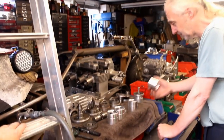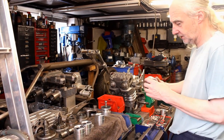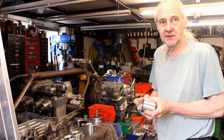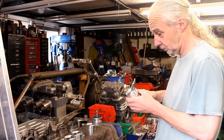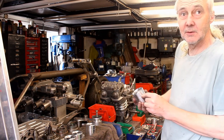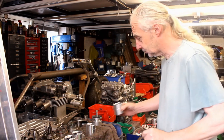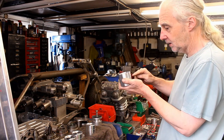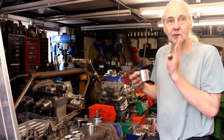Yeah, I've got a machine. What I'm going to do, actually, is set them up on the rotary table. There's nothing worse than trying to go in with one cut. With a cutter, you can quite easily have problems. Is this to cut the piston ring grooves? Oh, okay. I've got various sizes of slit saw. So I'm going to set them up on the rotary and spin it around very slowly. I'm going to go in with a slit saw and actually put the groove in.